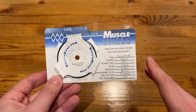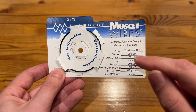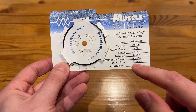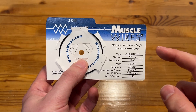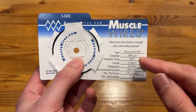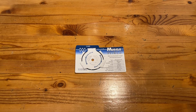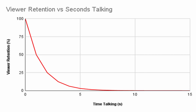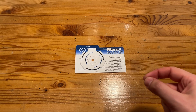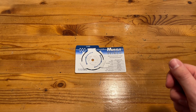The thing that we care about with this particular flavor of Nitinol wire is when we heat it past a transition temperature of 90 degrees, it'll pull with a pretty significant amount of force. For some context, this muscle wire that I have here is 200 micrometers in diameter, but can pull with over half a kilogram of force when heated. So this is all cool in theory, but let's get a physical design thrown together so we can run some real deal tests.